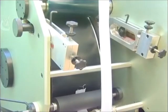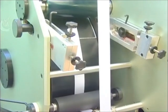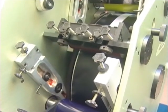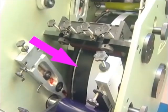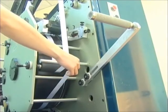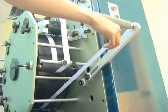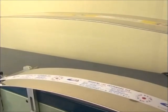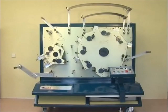There is a ribbon conveying roller in the middle of the printing station, which is used for conveying ribbon. A double-sided adhesive is mounted on the central drum, which keeps the ribbon fixed on the central drum to ensure it is not displaced. Two heating plates on the top are used for drying the ribbon after printing. The last section is the rewinding section.